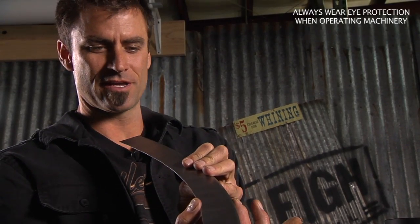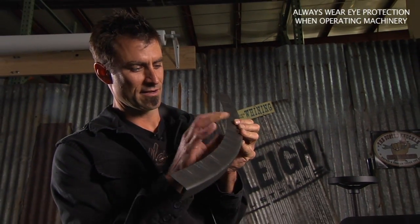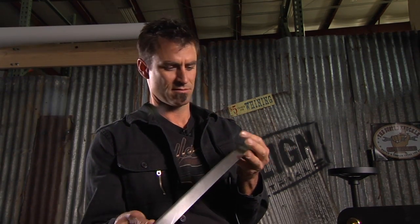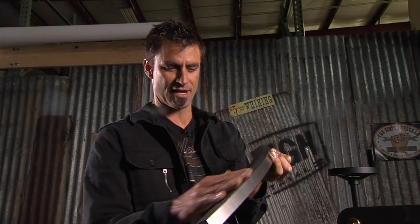An inch and a half is really hard to get a curve like that. I can actually see that the metal is getting thicker as it pushes itself together — it's really hard to get an inch-and-a-half flange to do that in 18 gauge.